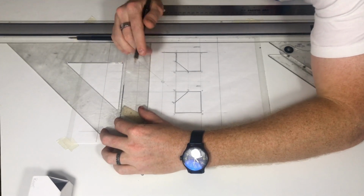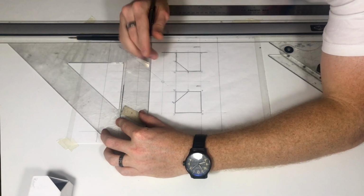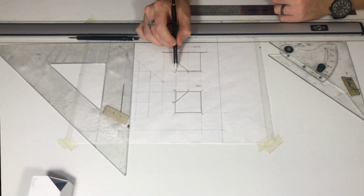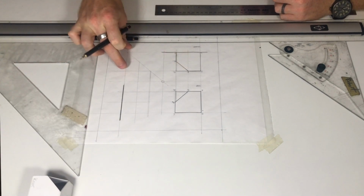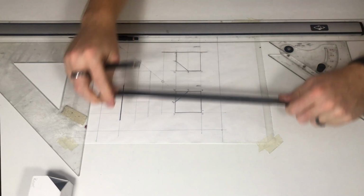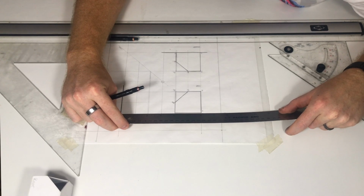If I line this up perfectly with these points of intersection, everything should translate with the exact dimensions it had over here. You see that that's 1/16, that's 1/16. Right? This space is 2, this space is 2, this space is 1 and 1, and we can always double check when we're first getting started and see that here we have 2. It's a little bit off.